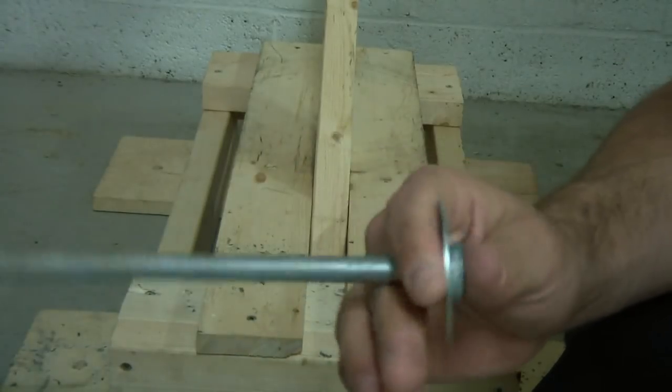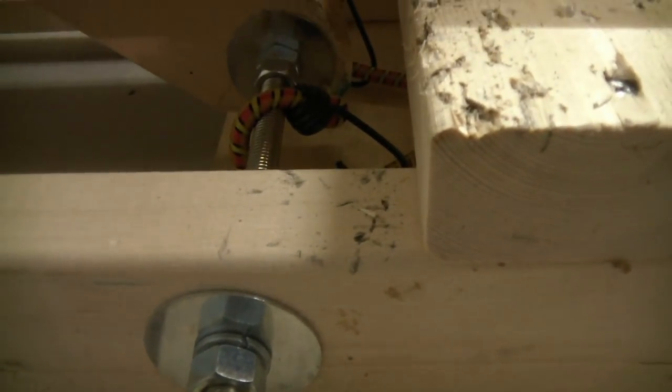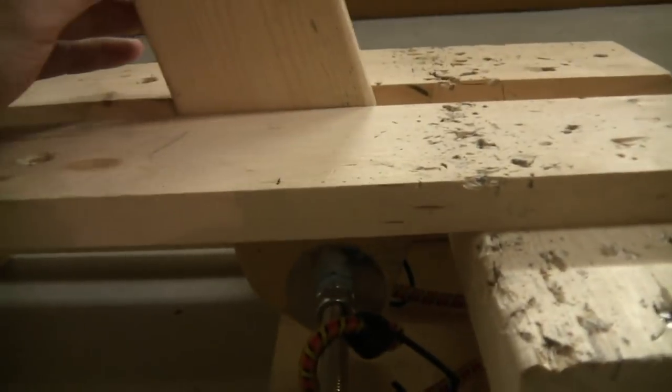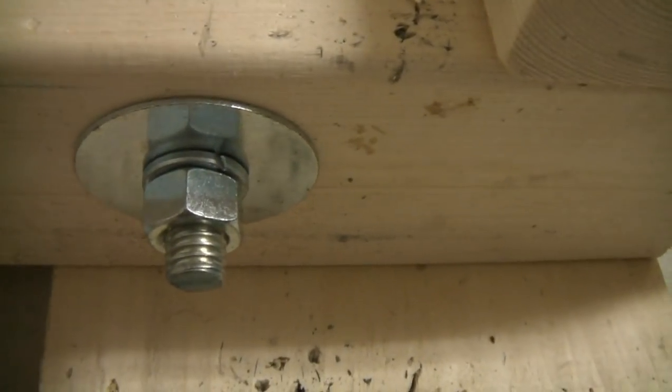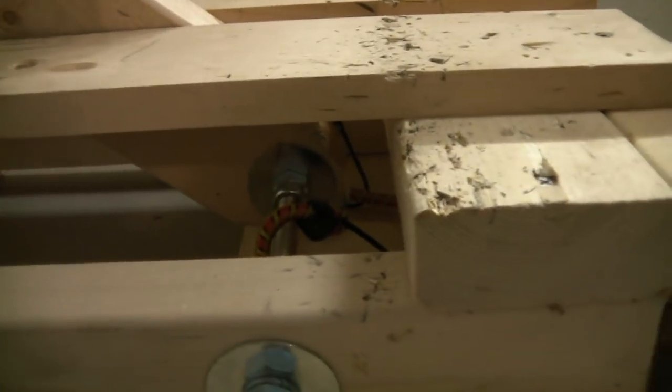The other piece you're going to need is a steel threaded rod — this one is a half-inch thick. I really don't recommend going any thinner than that. I drilled through the two-by-fours on each side and also into the bottom of the arm two-by-four so that it can move. I put lock washers on the inside with two nuts and a washer against them. It's really simple and easy to take apart, which matters because the arm can get damaged — that's part of why this target is so inexpensive.